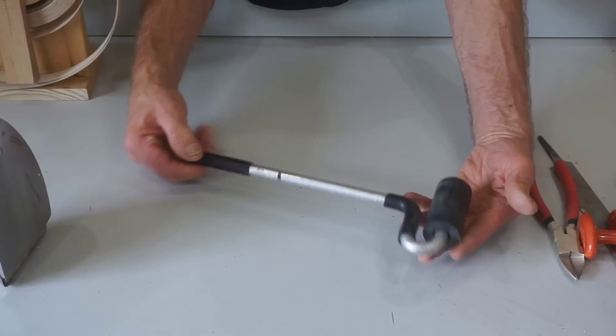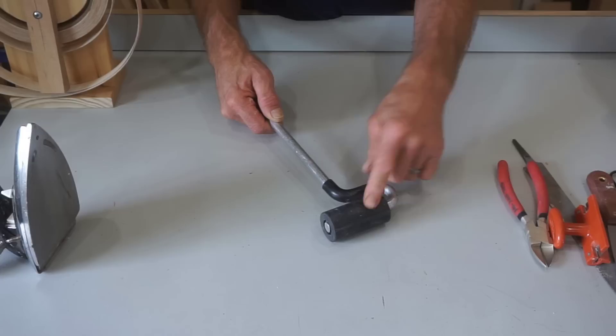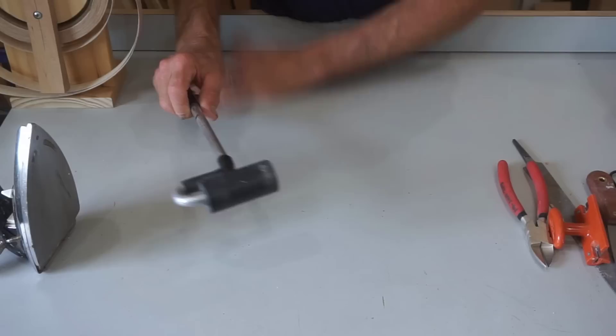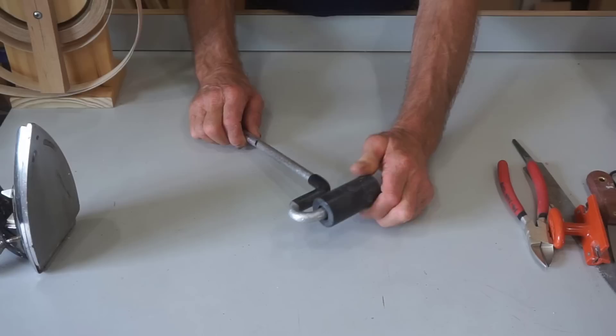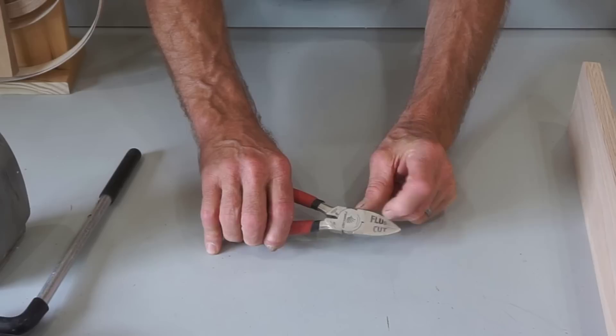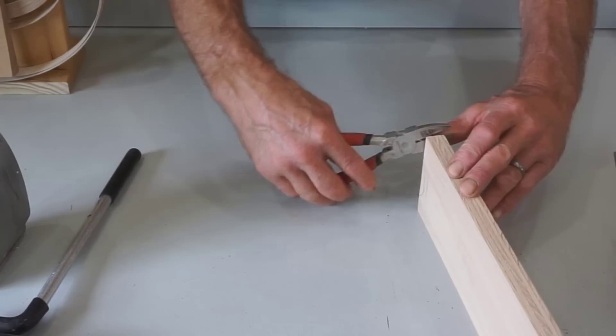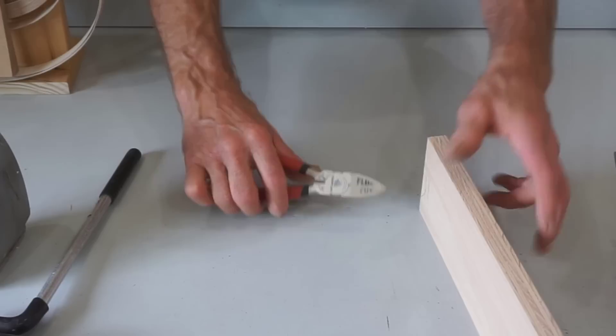After the iron, the next tool is a J roller. The wheel is a little bit cushioned — it has some forgiveness when rolling over the surface. I don't want a roller that's too hard or too soft, but I can get two hands on this and get a lot of pressure to compress the hot melt glue as it cools for a nice permanent stick of the tape to the edge of the shelf. The next tool is a pair of flush cut nippers. These are unlike electrician's side cutters because the edges are sharpened into a flat face — there's not a double bevel that pinches the wire. What this allows is a flush cut to the end of a surface, so one snip trims that edge banding quickly and nicely.